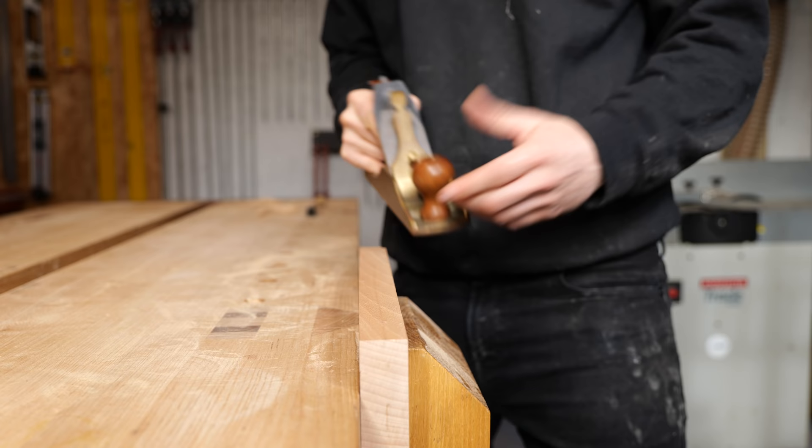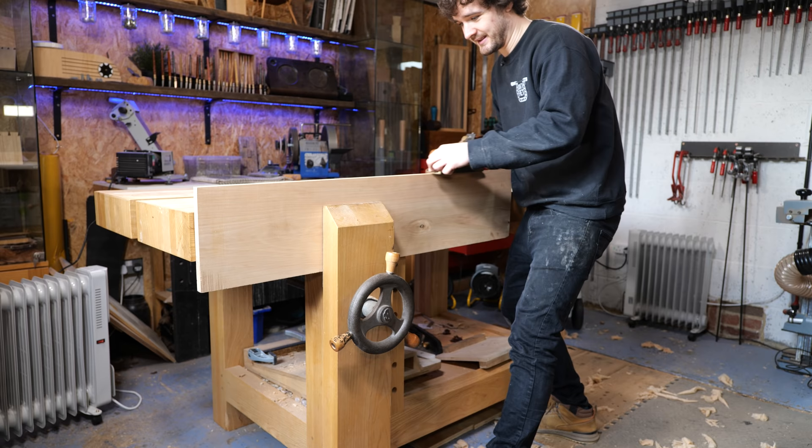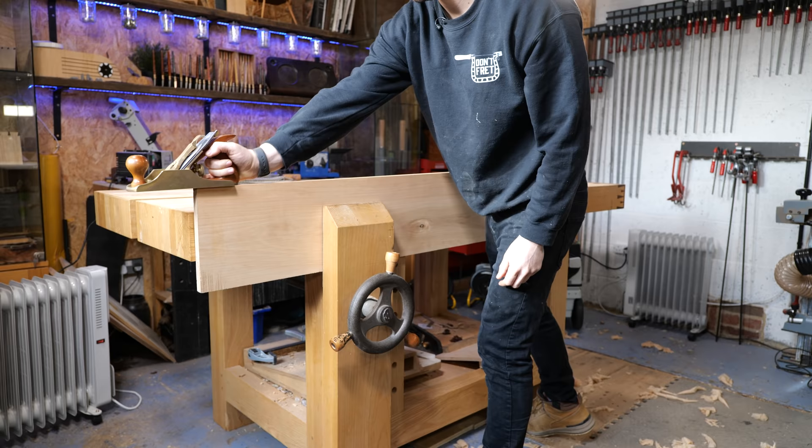The way I fix that is by locking everything into my body and carrying it through just with my legs. When working on longer pieces of wood, I'll opt for a combination of both legs and arm movements. If we just go for arm movements, I've got to reach all the way forward and there was actually a bit in the middle where I slipped — we can see it in the shaving. Whereas if we go for a combination of both arms and legs, we start back, reach the limit of our leg movement and then finish off with the arms. Much more controlled.